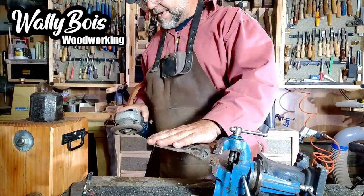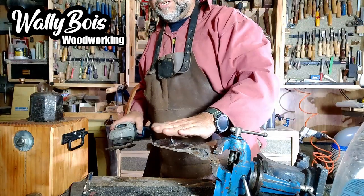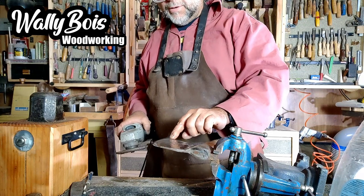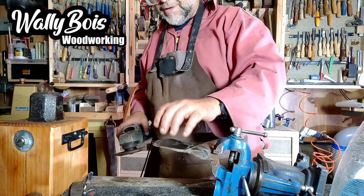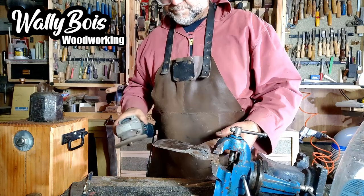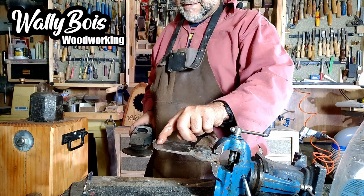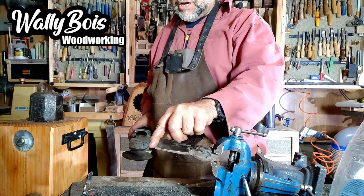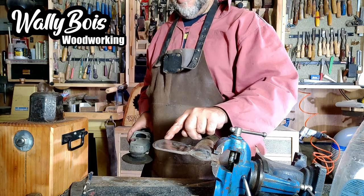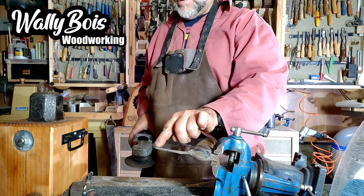Be wary of it getting hot. If it is, spray a bit of water on it. You'll see steam coming off but it's not that hot because I can touch it — that's not going to change the temper of the steel. If it gets too hot you'll damage your steel and you'd have to harden it again by heating to cherry red and dunking in water or oil. What I'm doing is starting with the angle grinder away from the edge and bringing it to the edge, because if you just sharpen the very edge you'll make it more blunt. You want to remove the fat material where it's thicker at the same time, because as you remove material you're effectively making the edge fatter.